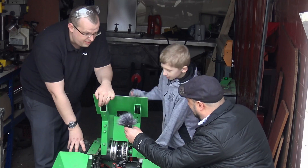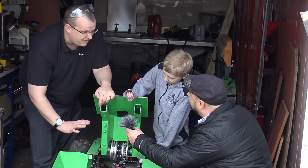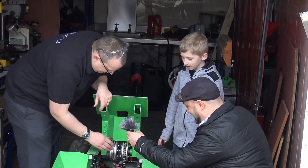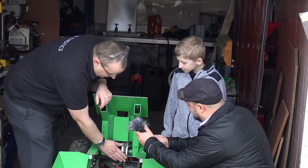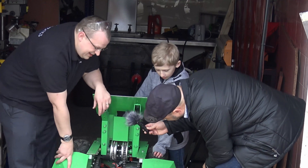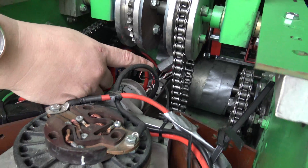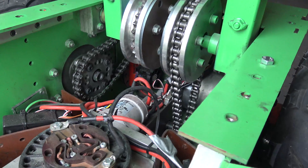The actual speed of the robot is probably about 18 miles an hour. The wheels are open to the elements, but they are basically sacrificial — we do carry plenty of spares if they come off in the arena. So we have a 33 to 1 custom gearbox for the whip. At the back end we have Bosch replacement 750 watt DC brush motors at 24 volts, on a 14 to 1 gear ratio from sprocket to sprocket.